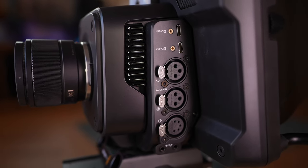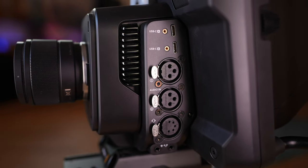Good. All of the studio cams have a tiny 1/8 inch audio in or mic in and TRRS headphone out, which means you could use them with headsets and communicate back to the control room. On the Pro version, having the big 5-pin is a more professional setup. So if you're actually working with the cameraman, that's probably what you want to use. And if you used it with the studio converter, you could add reference output and sync and all that stuff, which you wouldn't be able to do with the Plus.